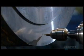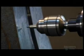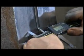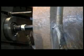An automated drill pilot drills the flange of the valve body, centering the holes used for the bolts that will connect the valve cover. A technician double-checks to make sure the holes are in the right place, then an automated spade drill starts penetrating the flange. Coolant prevents the steel from heating up and removes steel chips from inside the perfectly centered holes.